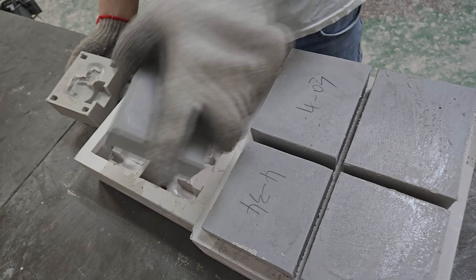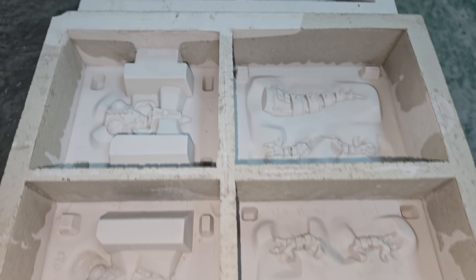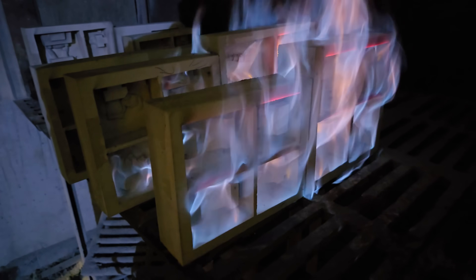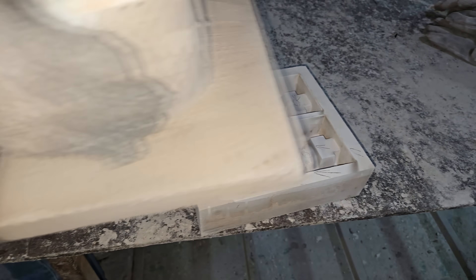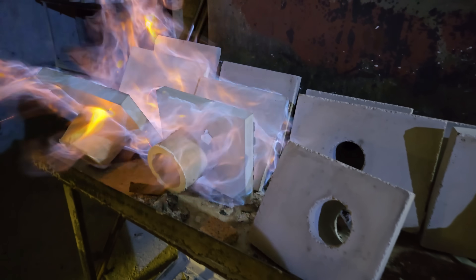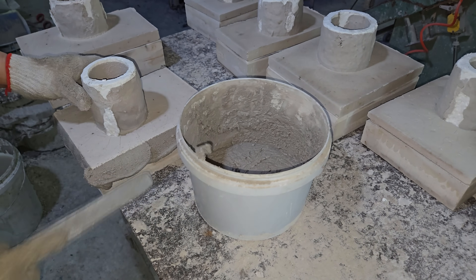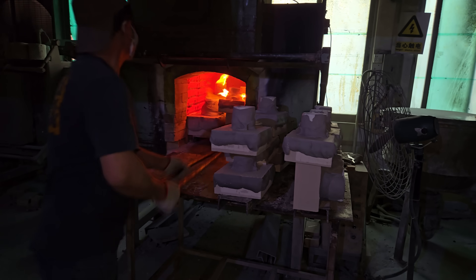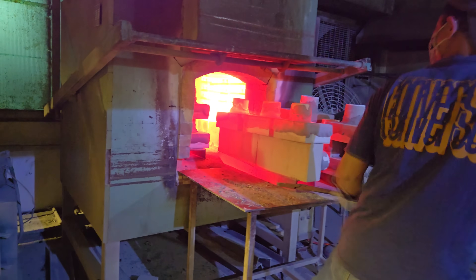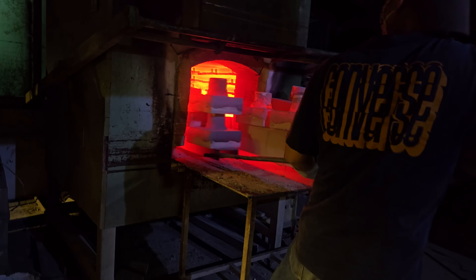The cavities in the ceramic are now a perfect negative of the final steel molds. These ceramic shells will be used one time only to cast the final steel molds from liquid metal. The ceramic is fired twice to harden it. Ceramic tops with casting tubes are made and also put in the fire. The first round is a relatively low temperature to bake out most of the remaining water without letting escaping steam damage anything. The two pieces are then mortared together and baked in a kiln at a much higher temperature — a process called sintering. The kiln is so hot that ceramic particles are melding and fusing into an interconnected matrix, giving the shells the strength they'll need to handle molten steel.